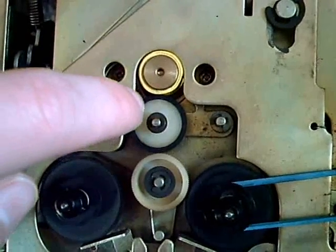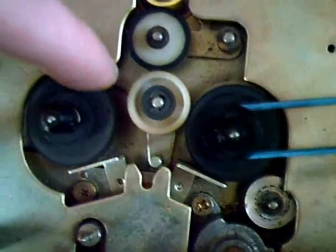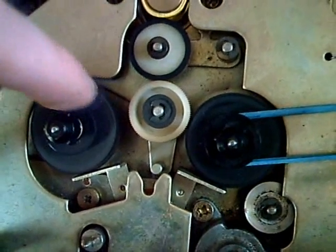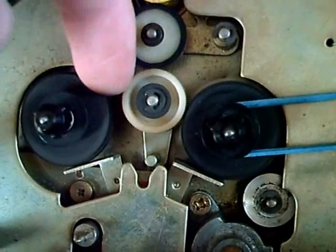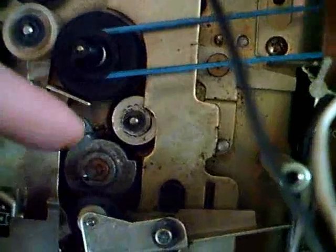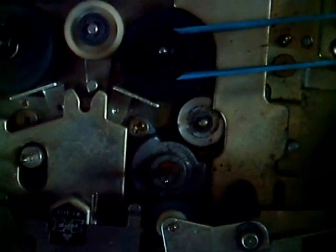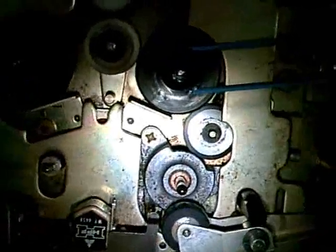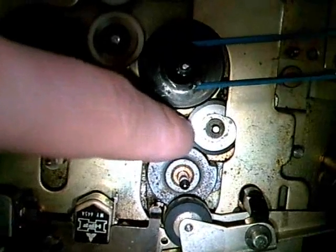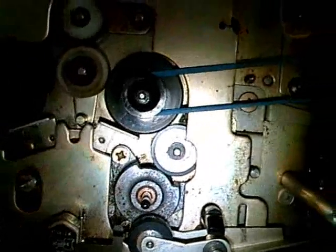You can see the motor and the duct tape I wound around it a while ago. And you can also see around the tables there's also some rubber, and I guess that all needs to be replaced, as well as also the rubber of this little idler wheel which is getting dark outside. This little idler wheel which is responsible for playback — maybe it also needs to be replaced.